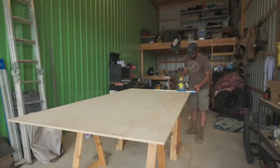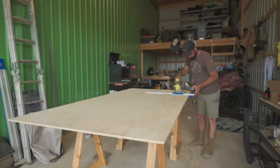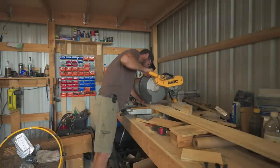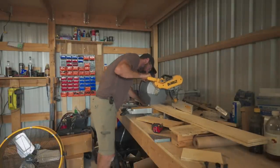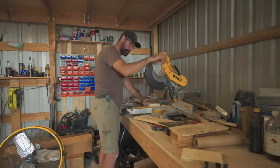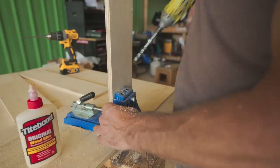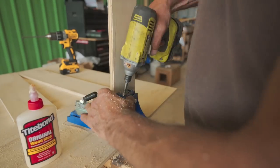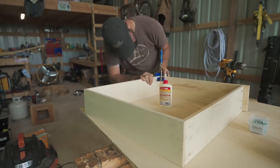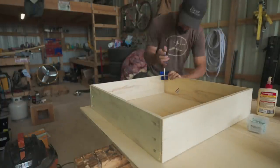With the front section done, I started cutting boards for the drawers using half-inch plywood and a Kreg jig to make straight cuts — not sponsored. I'm using a chop saw to cut the boards down to the proper lengths. I'll assemble the drawers using Kreg screws, so I'm using the Kreg jig to make pocket holes. Another Kreg tool that helped a lot is the corner clamp — it really helps keep the boards aligned while screwing in the pocket hole screws.